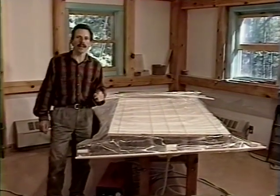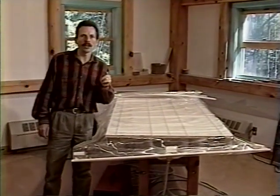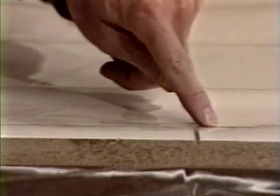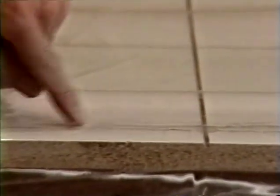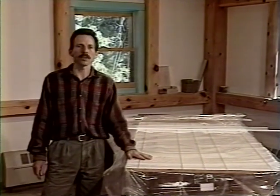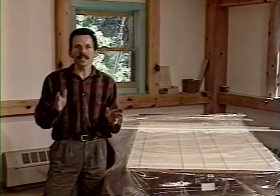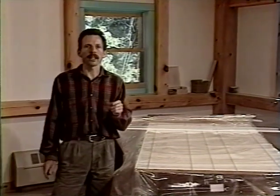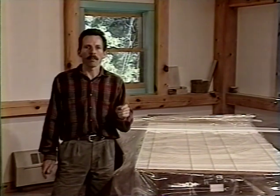The last thing I keep track of with the bag is glue buildup in the grooves of the platen, mainly right around the exit hole. If glue blocks up these grooves, the air can have a hard time getting out of the bag, which can make the pump cycle erratically. This erratic cycling of the pump is the number one problem that can develop with a vacuum system. It's nothing major and is easily remedied if properly understood. Erratic pump cycling is almost always caused by a condition I call flow restriction.